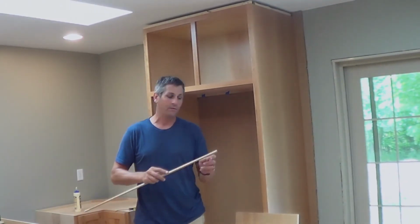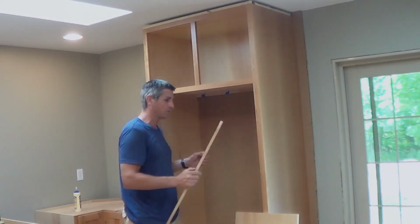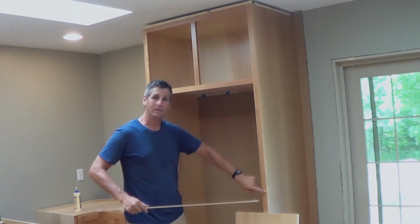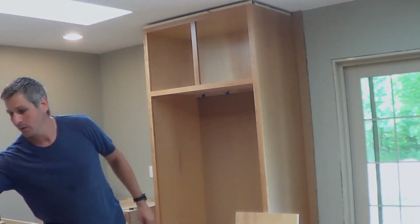If you pull this strip off and these tacks stay in, and you stand this front frame up and you're moving it around on your finished floor, those tacks will gouge the heck out of your floor. When you remove this tack strip, make sure there's no more tacks protruding from the bottom of your front frame legs. Very, very, very important. We've learned the hard way.